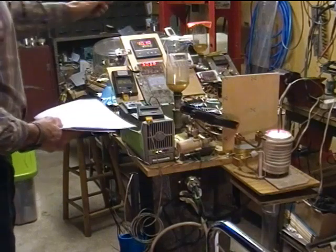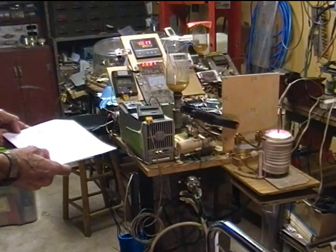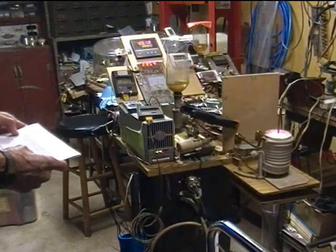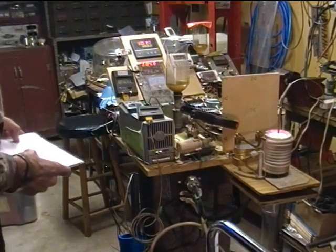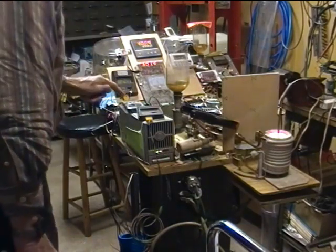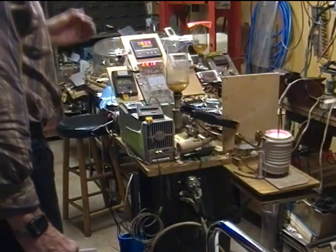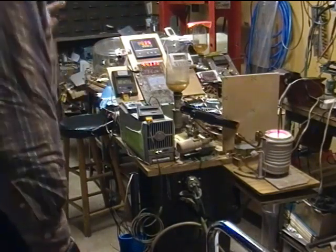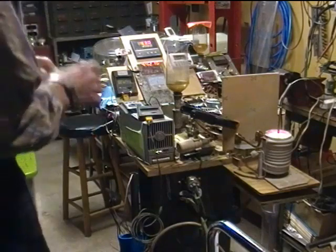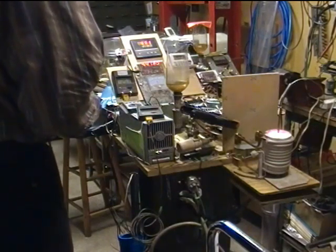I've put two useful links in the description to help you set up the PID controller. Now let's take a look at what percentage of the time the unit is on. The temperature of the heat sink is 97 degrees now, dropped back from 101 because now we're starting to cycle back and forth. The top of the SCR is barely warm. I'm going to try to catch the time when the heat goes off to get an idea of what percentage of time we are on.